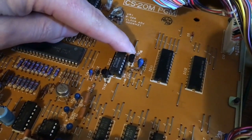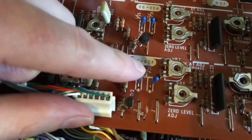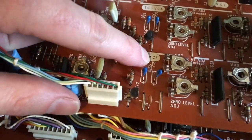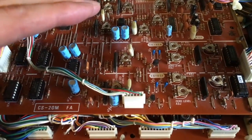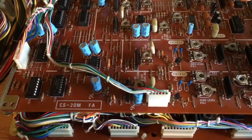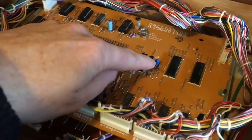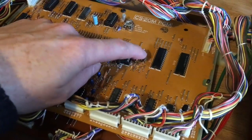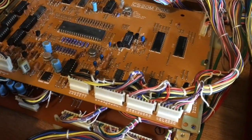So you can here see 10 microfarad, 16 volts, anything with 16. It's not as critical to replace the tantalums that are 35 volt rated because they're quite far above the supply rail. So, I mean, the supply rail here is probably 15 volts. So 35, that's enough margin. But these ones over here that are 16, that's really close to 15. So no wonder they blow up after time.